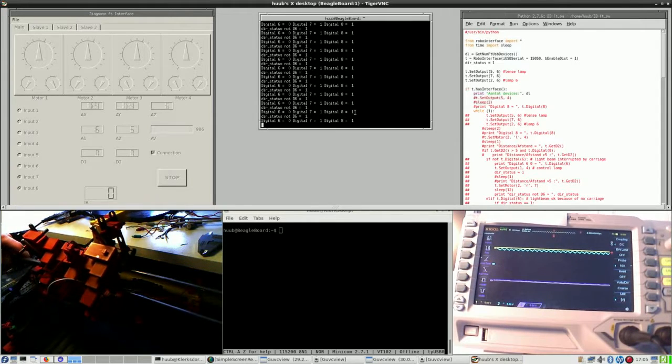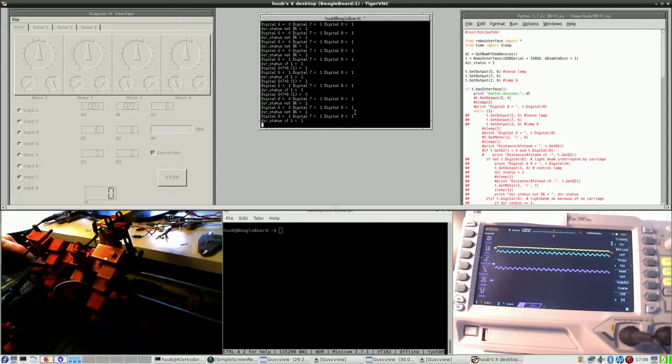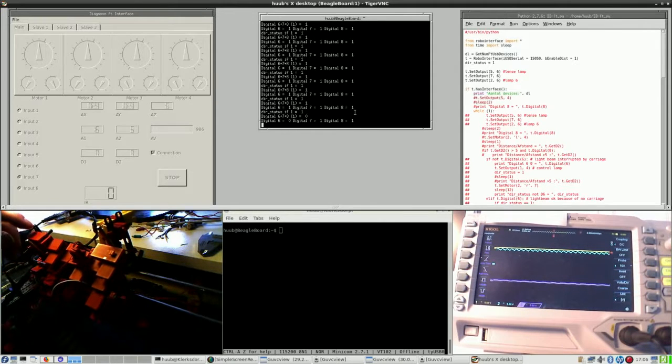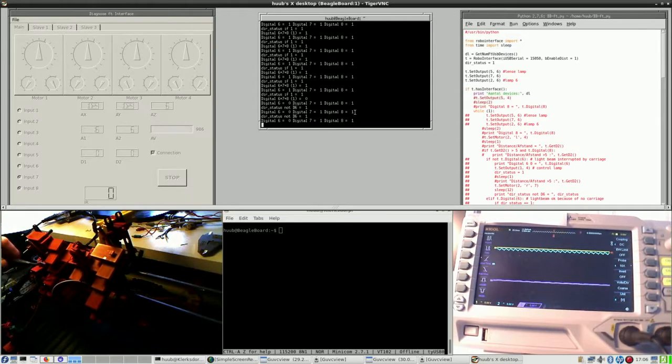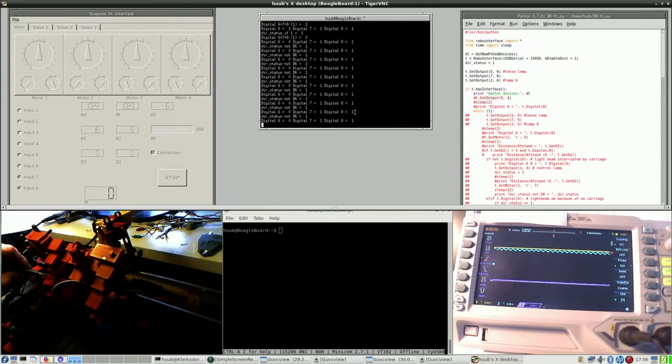Well, you can see what happens. And put just mild pressure on the roller. Let me put mild pressure on top. That did work last time. Not now. Here there is clearly signal on the blue, on the purple line. Not so much here. Here there is. So there is hardly any contact.